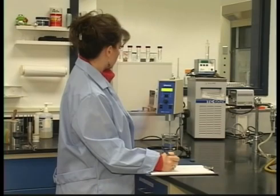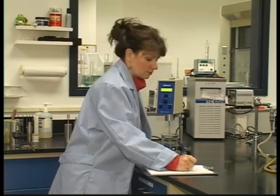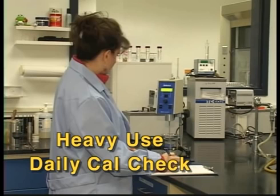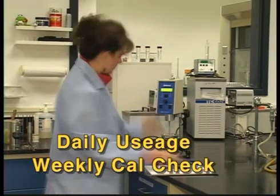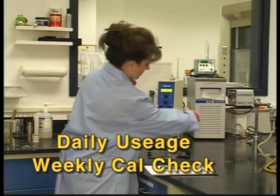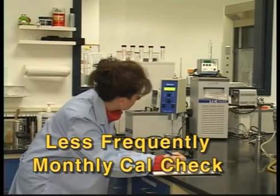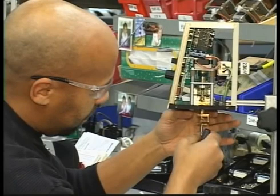A common question is: how often should a calibration check be run? The answer depends on how often the instrument is used. For example, if an instrument is being heavily used — say on multiple shifts — a daily calibration would ensure accuracy. Daily usage five days a week may require a calibration check at least once a week. For instruments used less frequently, once a month or once every few months will be fine. But to ensure the health of your instrument for many years, return it to Brookfield or an authorized dealer once a year for a full calibration, certification, and cleaning.